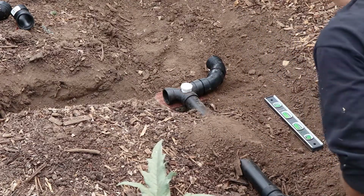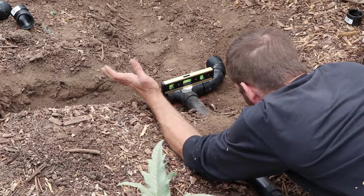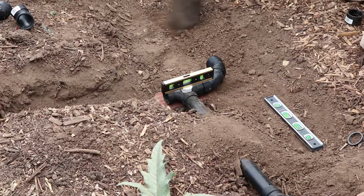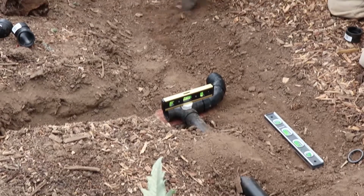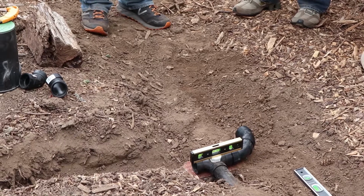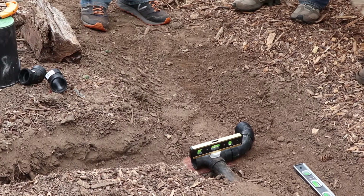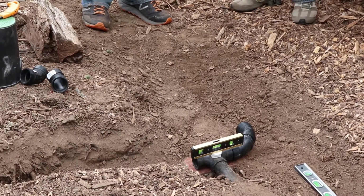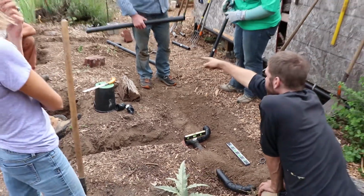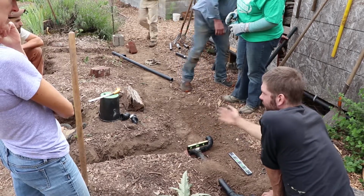Can I see that level again? Sure, we didn't throw ourselves off. Still perfectly level. Okay, nice. Start laying in longer pipe. I think for that application, we have some 10-foot sticks here. We can just get an exact measurement and cut it off, so we're not using a bunch of couplings. So we're going to glue this one now, right? Or do you want to do the 10-foot? It doesn't matter. We might go all the way here so we have a solid point and kind of bury some of this so that when we get to that, it doesn't move.